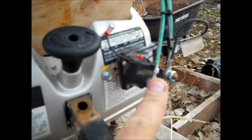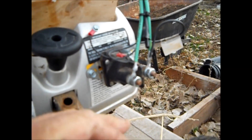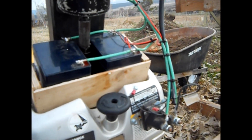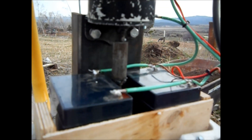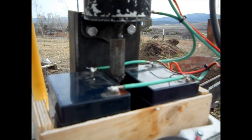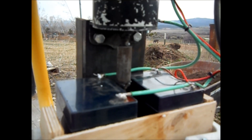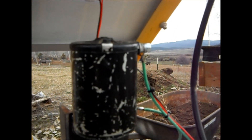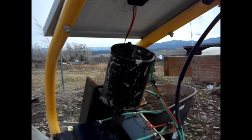Here it is with the motor installed — it did work like I wanted it to. I simply added two of my batteries, connected them through a starter solenoid that I scrounged off a mower, and used the existing switch on the unit. It's a pretty simple setup. The connector is just a piece of 7/8-inch shaft that I drilled and connected to the part from the rototiller, so I really had to make only one piece for the drive shaft. And there's our little solar panel, which should keep these things charged.